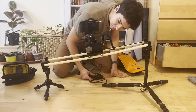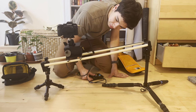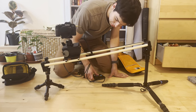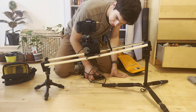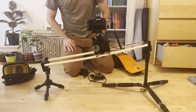Instead of the motor pulling itself along a length of paracord, the motor now pulls itself up an incline and then lets the slider slide back down in a controlled fashion. This means that there needs to be an incline for the system to work, and that incline also can't be too large or the slider will fall off because it's so top-heavy. So this all isn't ideal, and it's the biggest weakness of the final design in my opinion, but at least it does work within the constraints set by the design.